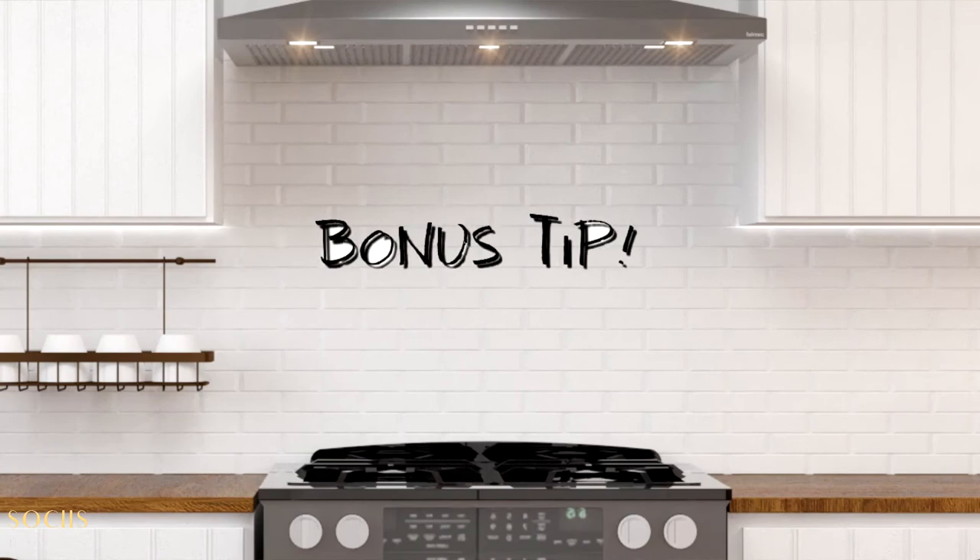If you don't want to invest in pot lights or change your electrical, you can simply switch your existing light fixture to LED discs. LED discs are very thin, they look like pot lights, very discreet, and they are just mounted to the surface of the ceiling like a regular light fixture. I would also suggest using under-cabinet lighting, which will light up your work counter and warm up your kitchen as well.